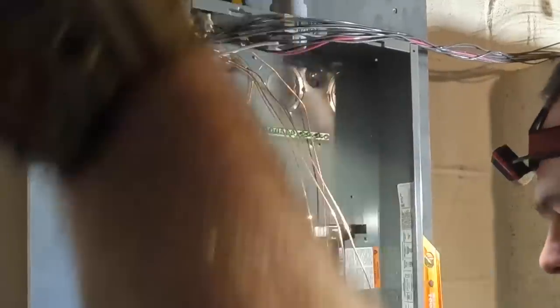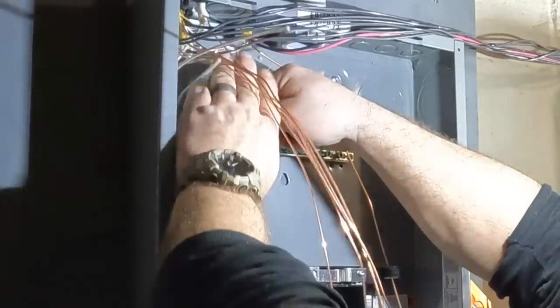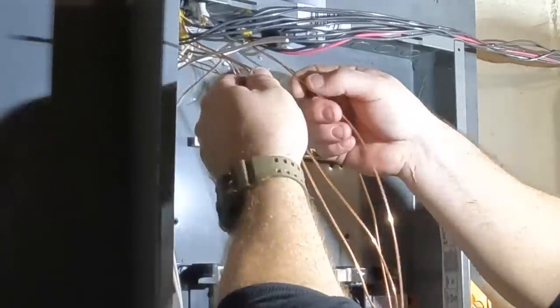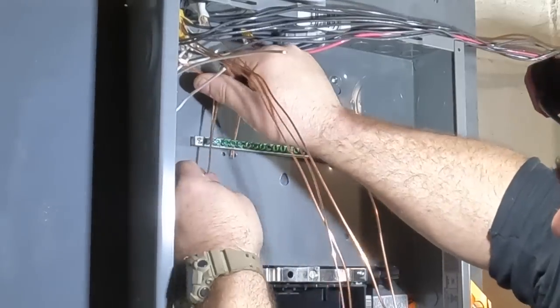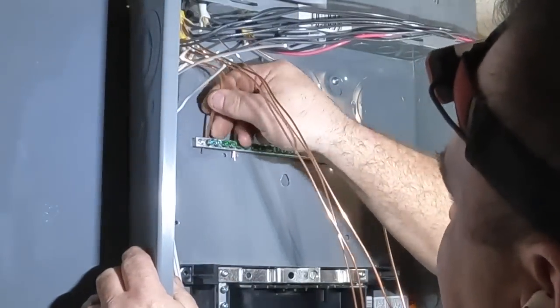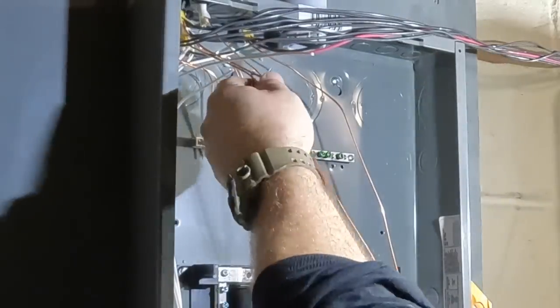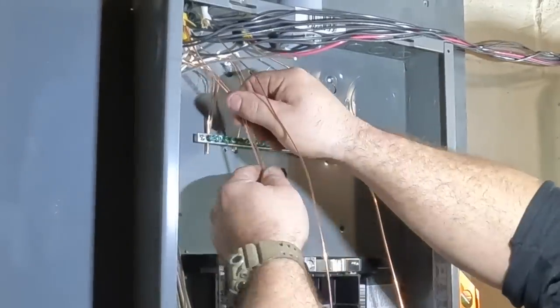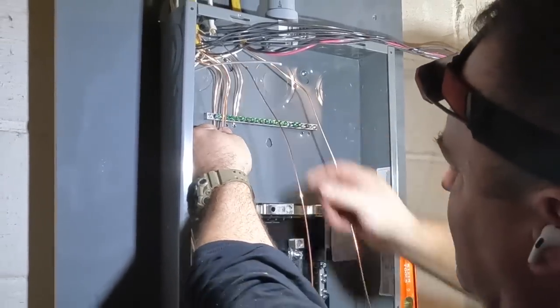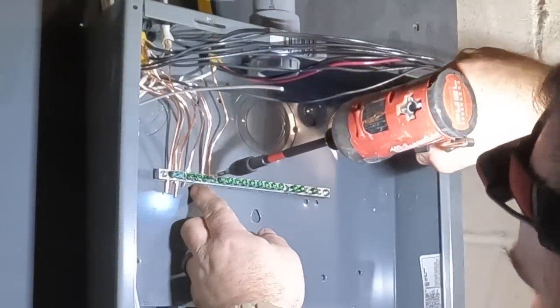I like to make a nice clean panel, which is why I put the ground bar up at the top. I'm doing two equipment grounding conductors of the same size — both are either 12 AWG or 14 AWG — under the same common terminal. If you were to use a 14-gauge EGC and a 12-gauge under the same terminal, your inspector could knock you down for that. We're trained to put the same size conductor under the same terminal. You're only allowed to double up equipment grounding conductors — you cannot double up grounded neutral conductors under the same terminal. That is a violation because the grounded neutral conductor is a current-carrying conductor.